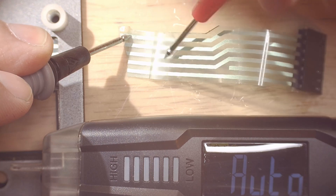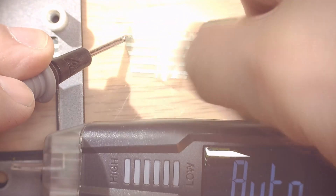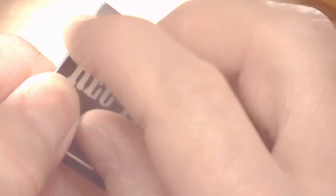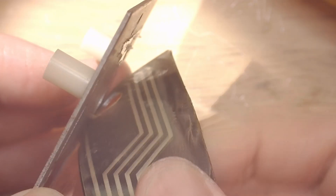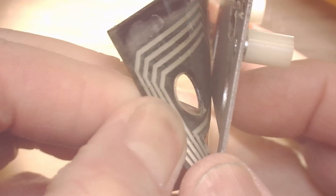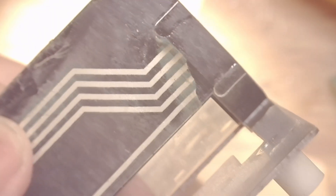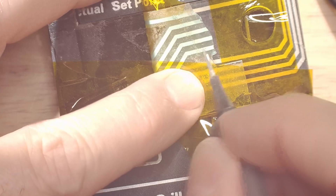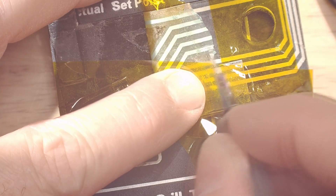We do see low resistance, so we might be able to repair this. We'll just cut it straight — cut it back probably about a half inch — and that's probably all we're going to be able to do. The problem is we're going to still be really close to the bend. We'll try to pull this back and separate it, see how far back we can go, being careful not to let it peel or break the traces anymore. Let's be careful right here as it comes loose really well. We can take this part and fold it back, clean it up good with some alcohol and get all the adhesive we can off. Using really sharp probes and being very gentle here — we'll speed some of this video up — scraping through till we see silver, then cleaning it off with some alcohol. I believe we can do something with this.